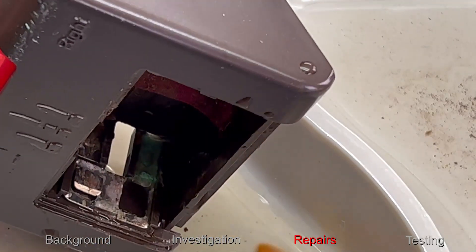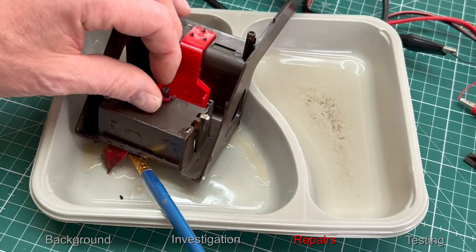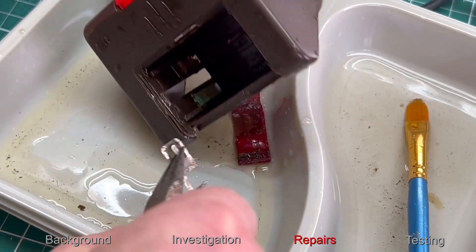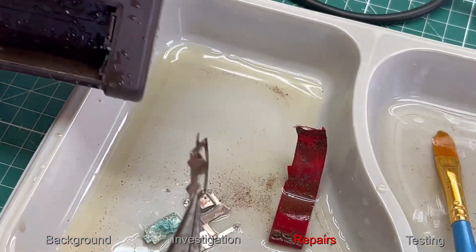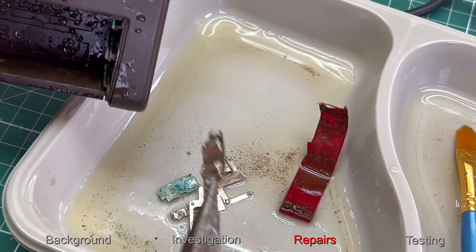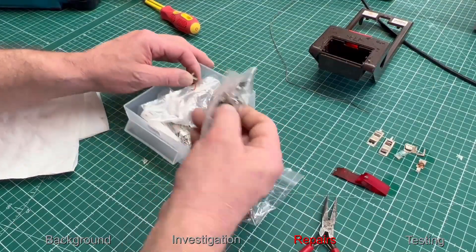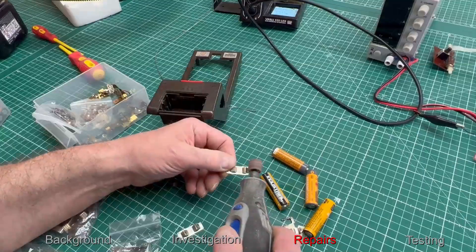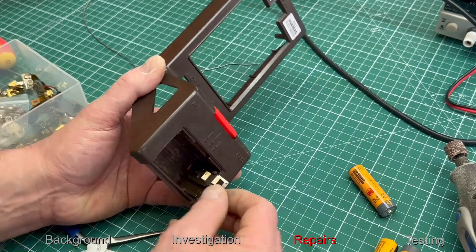Because of the corrosive nature of the battery leakage, I apply white wine vinegar to neutralize the alkaline from the batteries. I'm also going to remove the piece of red material used to extract the batteries, as it is badly contaminated, and replace it. Let's take out all the battery contacts from the battery compartment and see if it's possible to reuse any of them and identify which ones need to be replaced. It looks like I'll be able to retain a couple of the battery contacts once cleaned up, and find alternative ones for those beyond repair.